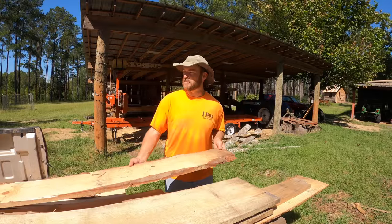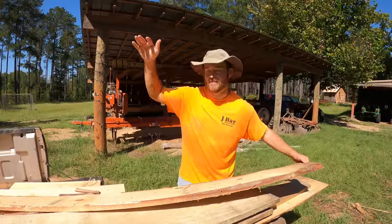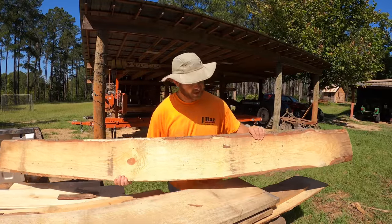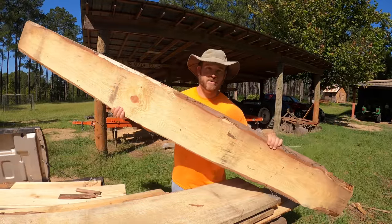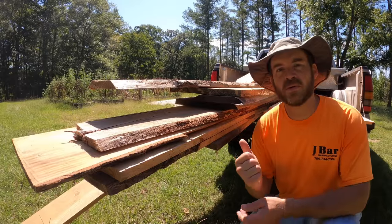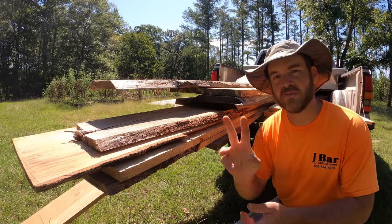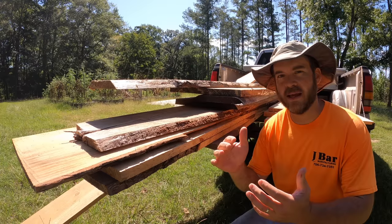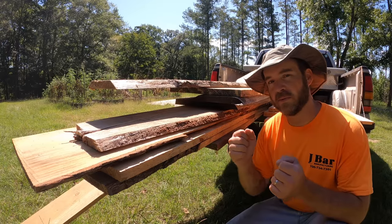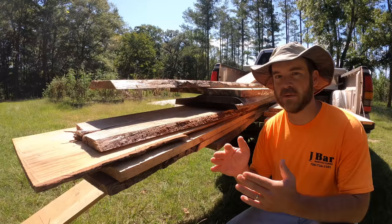It is time to get back on the living room project with some seriousness, and our first task is to finish up the ceiling. What we're going to need to do is make some more boards — take boards that look rough and make them look finished. I've got 13 boards here on the back of the truck. These boards have been stacked and stickered inside the house for two weeks to acclimate, and I want to put them on the sawmill, then the planer, then get the router and put shiplap edges on them so we can put them on the ceiling.